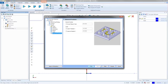The advanced feed rates, you guys will see these all the time. Pretty much every week we do one of these webinars, at some point there's going to be a page that talks about the advanced feed rates. The advanced feed rates allow me to convert rapid moves to feed moves. So instead of outputting G00s, it's always going to output a G01, and on that G01 line, it's also going to output a feed rate. So you're overriding the rapid moves; there are no more rapid moves called out. They're converted to these feed moves. So you can set up your own feed rate specifically for your feed moves.